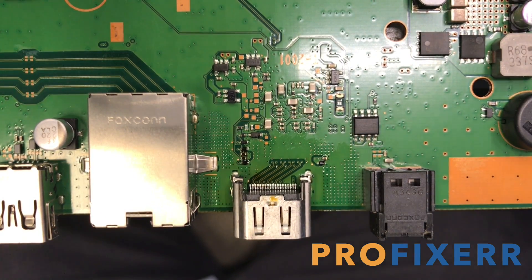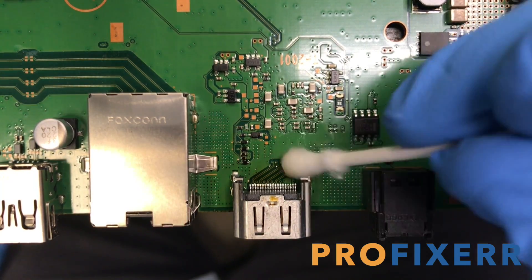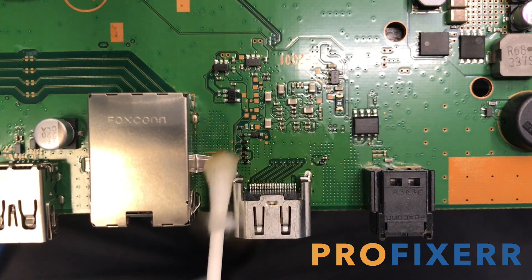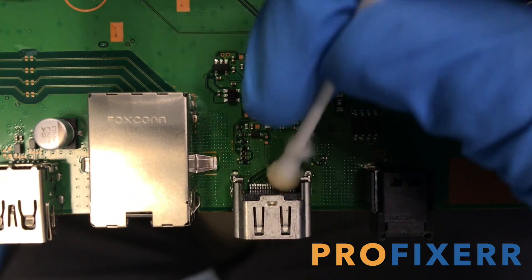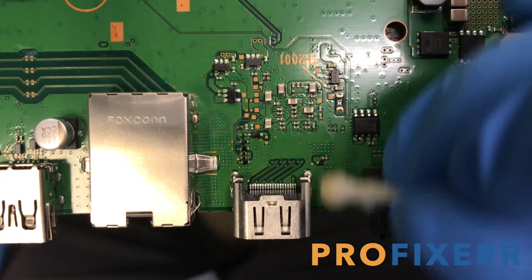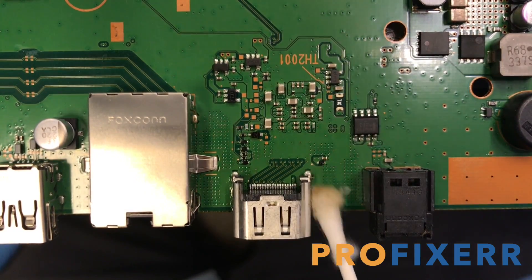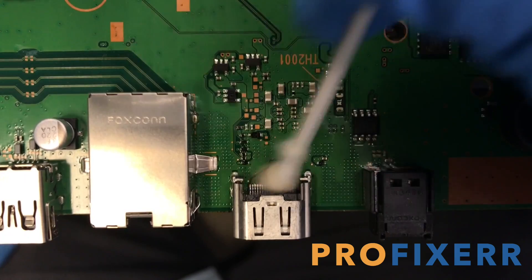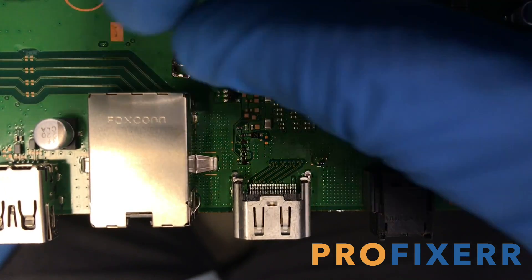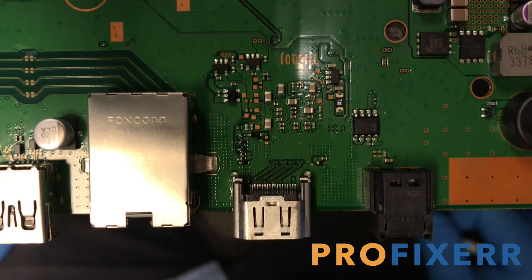Now if you can see, we have all of the port soldered — the anchors on the side done and all the pins in the back done. Now all that's left to do is clean it up with a little bit of isopropyl alcohol. I use 99% isopropyl — it works really nicely to get all the flux out of here. I clean it up with a q-tip to get most of the gunk and residue off, and once I'm sure I got all the big chunks and most of it out I use a toothbrush to get in between all the little pins, then blow it out with some canned air. But this is how you solder an HDMI port on a PS4. Hopefully you found it interesting — we'll be doing more in-depth videos on HDMI ports, so stay tuned and subscribe. I hope you all found this interesting and useful. Y'all have a great one.